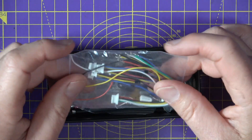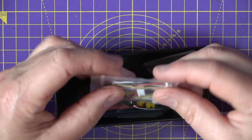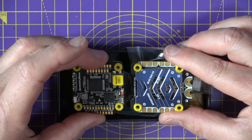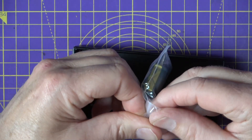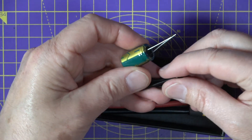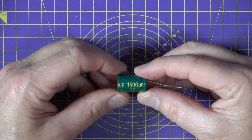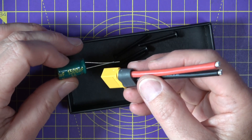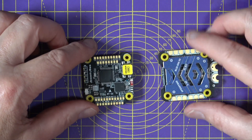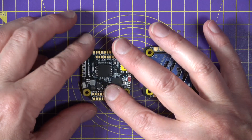Looking in the bottom of the box, there's a bag of wired connectors for cameras, VTX, DJI air units and so on. There's an interconnect cable to go between the ESC board and the FC PCB — no soldering involved there. There's additional soft mounts and mounting hardware, M3 bolts for mounting the PCB stack, and then a massive 1500 microfarad 35-volt low ESR noise suppression capacitor, plus a wired XT60.